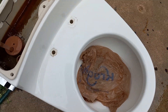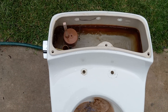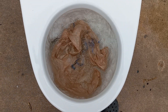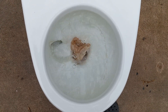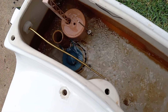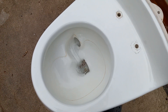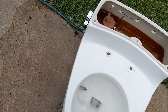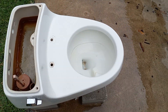I don't know how it will do on this. I think it has the ability to pass it as long as it doesn't take it too late in the flush. The tank is almost full — let's see how it does. The flapper is not closing because the water in the bowl is at the same level as the water in the tank. I believe that did about as well as the Rochelle did. Honestly I am sort of impressed because it has a very small trap way.